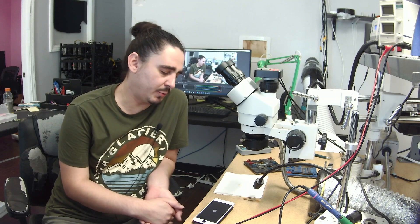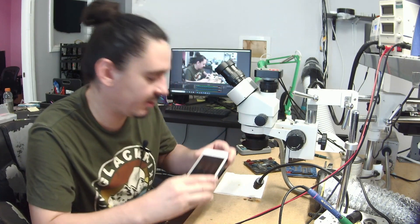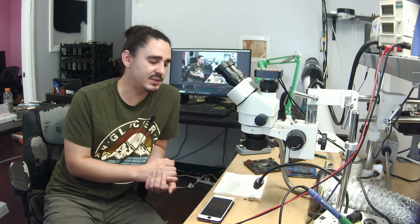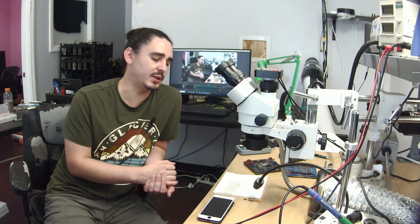When you have simple breaks like this, usually a technician broke this during a screen repair. When you have little breaks like this, you should just do the proper repair — it's very easy to find a new transistor, replace it, fix the pad, and do a couple of diode mode measurements to make sure everything is good. As you can see, this is reading 46%, so now it's reading battery data and it's no longer going to give a three-minute reboot — this phone will just work properly. If you can do a proper repair, it's way better than the jumper solution. This one you just want to get that transistor back on there so it can read the battery data and the phone can function normally. Thanks for watching!